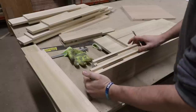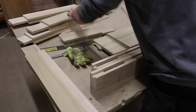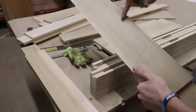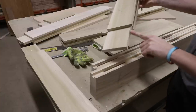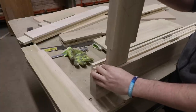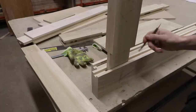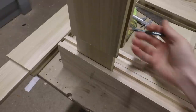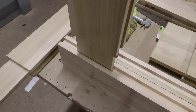We're looking at the top rail here, so we can still see our markings out from when we set out that mortise position. I'll just grab the top rail, and we're looking to put that inside edge where it's got to go against that panel. We're going to push that line that we've just machined back with the groover against the front of that mortise, like so. So it's going to sit in that mortise nicely, butted up to the inside edge here. So that position there wants to be dead tight. So that's what you're going to wedge the tenon against to reference a square position on your door.